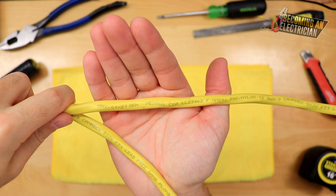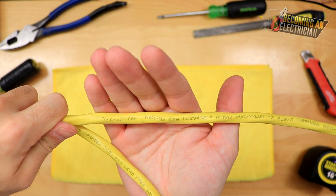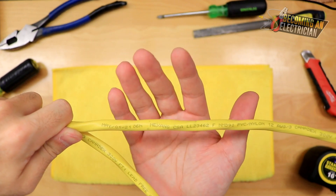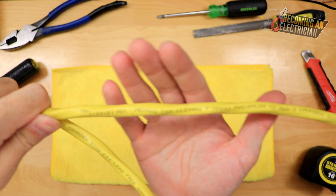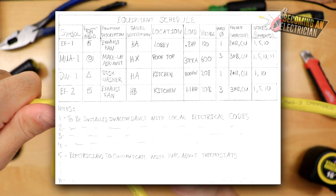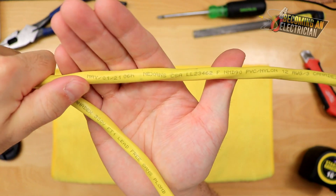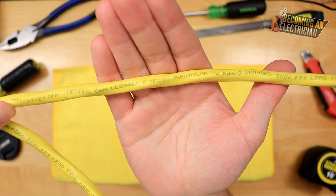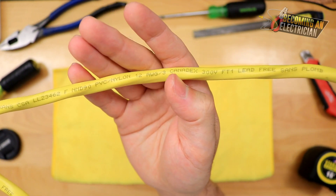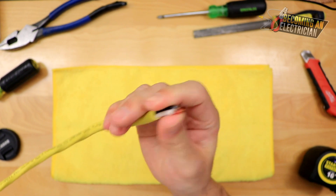This is really important to know because as a general electrician you'll typically just pick up a wire and start wiring for general purpose stuff, but as soon as you start dealing with certain equipment — like an air conditioner — it's a bit special compared to a basic plug and you have to pay attention to wire ratings. On a commercial job site your prints will tell you wire type, wire size, voltage, and phases. Looking at the 12-3 label: NMD90 jacket, 12 gauge, three conductors, 300 volts, and FT1 — so be careful in plenums because if it burns it produces toxic fumes.